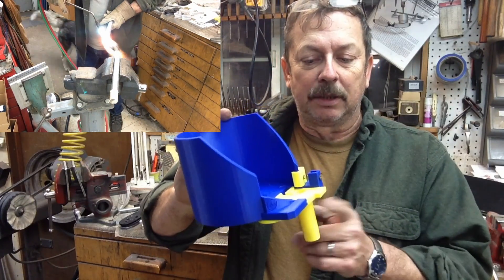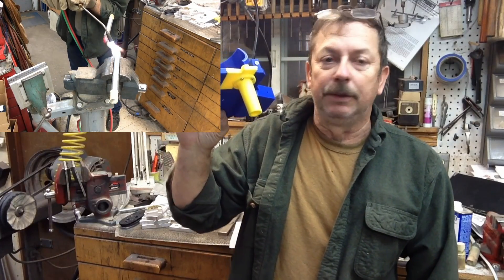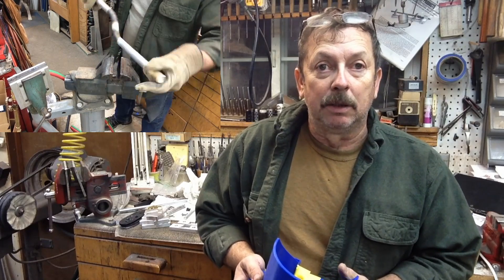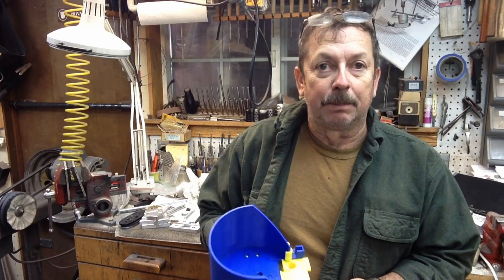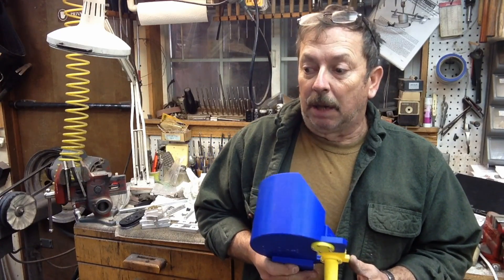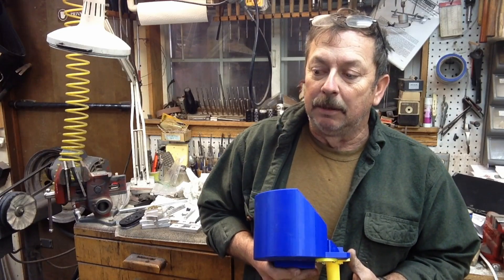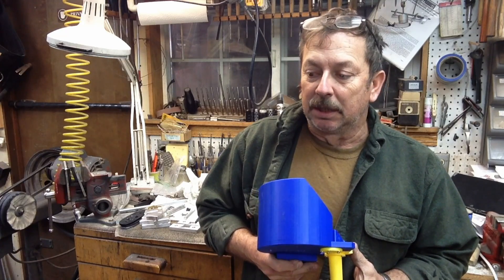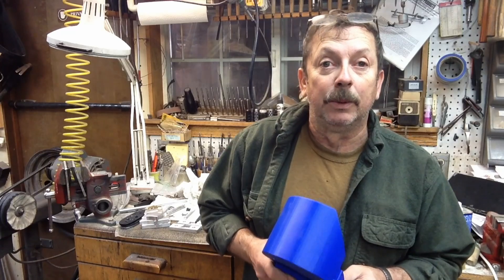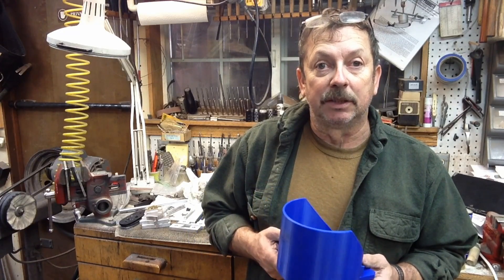This is the configuration I think I'm going to use. I don't know if I'll run the down-feed tube here or out of this spot — we'll decide that once it's mounted. It'll mount up onto the press at about a 45-degree angle, and the spring runs down into the bullet collator feeder. Once the upright support is powder coated and installed, we'll go back to the press and tune everything. I have the motors and the optical sensor for the shutoff, but the speed control was shipped China Post, so that's going to be a hold-up.